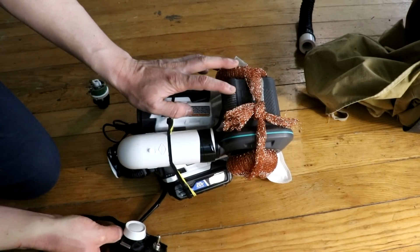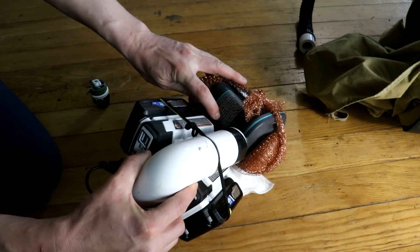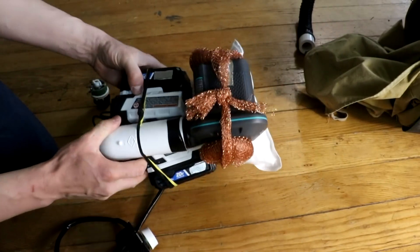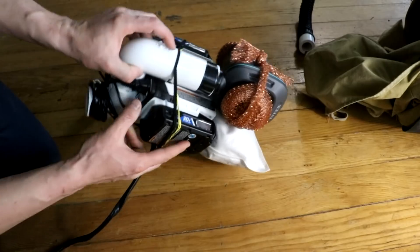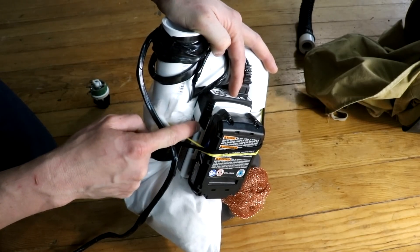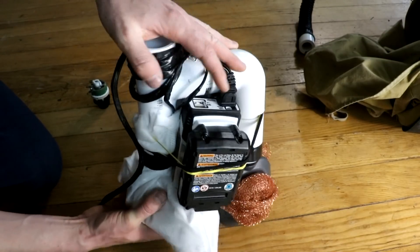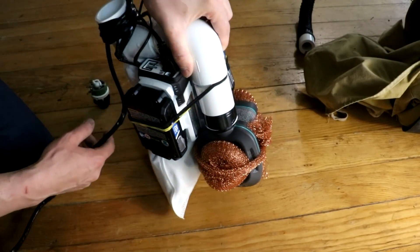Unfortunately they still overheat. I can't run on just one blower for very long — the duty cycle says 10 minutes on, 10 minutes off, so it's a 50% duty cycle, which means I need two blowers, as you can see. So I need to switch between them, and I've got a little switch here to do that. As it turns out, I also needed more than one inverter because the inverter gets hot as well. So I've got complete redundancy — if one side dies, a battery goes dead, something happens, I've still got 10 minutes to figure out the problem before the other blower starts to overheat.